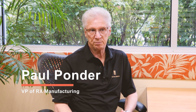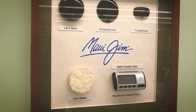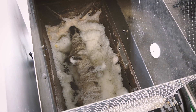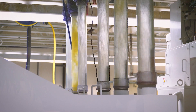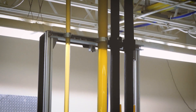As we start the whole process of making a pair of prescription lenses, they go into what we call an orbit generator. It generates swarf as it cuts that lens down to prescription thickness. That swarf is flushed out with a fluid — that fluid is used to cool the lens during the cutting process and it acts as a wetting agent to flush it through the evacuation tubes.